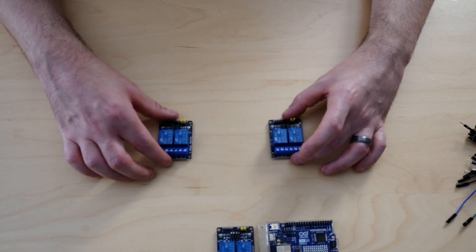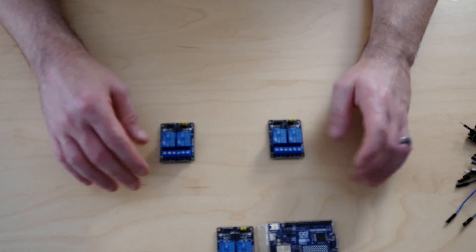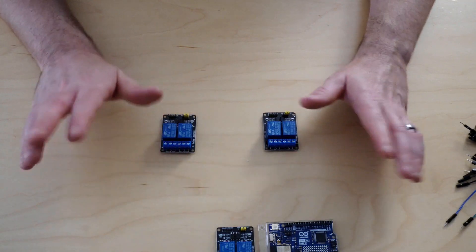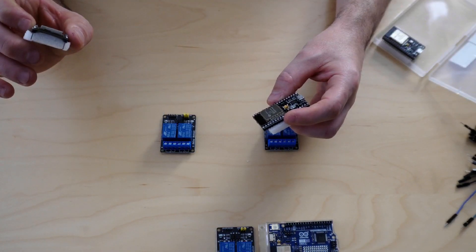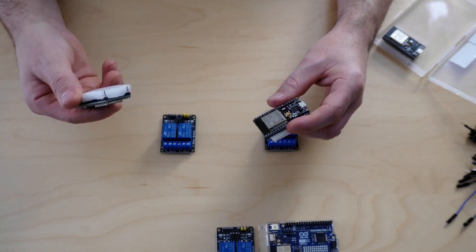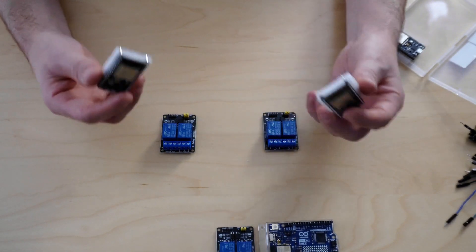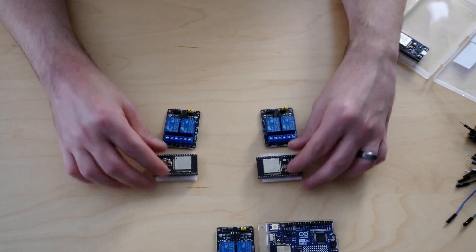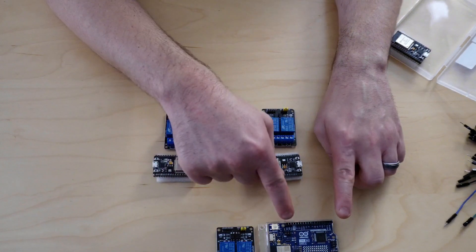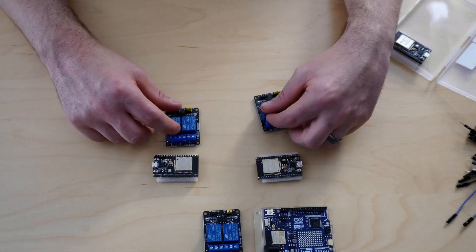These are the control nodes — two relay modules. No wireless connectivity or anything like that; these are your standard relays. They're not solid-state, so they do make a clicking sound. I kind of happen to like the clicking sound, but maybe next year we'll go solid-state. These are an ESP-32 — I think this is an ESP-12E, NodeMCU. There are so many different ways these things are called; it's easy to get confused. But those are going to be paired with these, so this will control whether the relays are on and off, and the Uno is going to tell these when to turn these on and off. Pretty straightforward, I think at least.